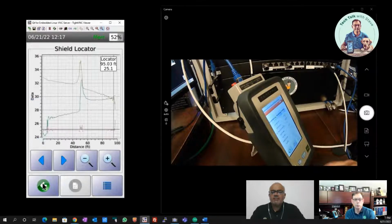Right. And it's good to have the ability to see this from the main and the remote as well when it comes to step TDR, correct? Correct. That's why the tester shows two types of TDR plots, one taken from the main end and the remote end. So it helps to look from both ends. And I think from the remote also you can view both plots.